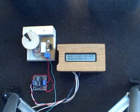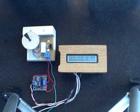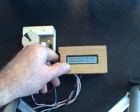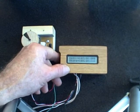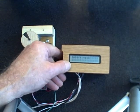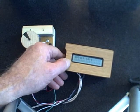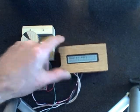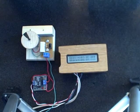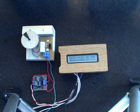The first thing we want to do is make an adjustment for the differential — in other words, set the differential temperature at which the pump comes on. We press the top button here, and right now it's set at 10 degrees. Let's raise it to 15 degrees. The top button raises it and the bottom button will lower that control. So we have the differential at which the pump comes on set at 15 degrees.